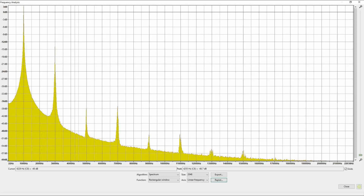What we're looking at here is the overdrive at about plus 6 dB, and look at the peaks on that. You can do the math and work out where they're going to be, and they are perfectly where they should be. Unfortunately, you don't want them there, because that's noise over and above the sound of the tone that you're recording. That's the zzz you get, that's the distortion and the general mush. So if you're driving that hard, you will get that, and that will be added to your music.